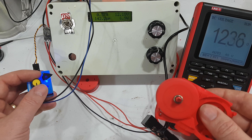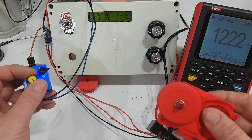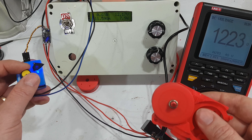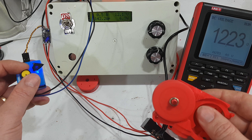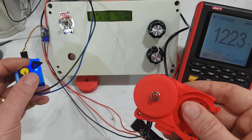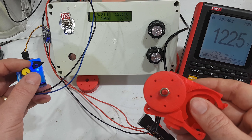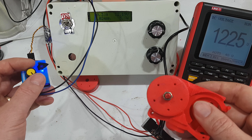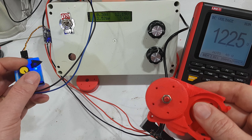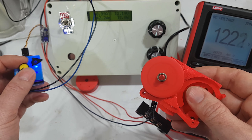There are ways to filter the regenerative voltage from going back into the Arduino using a Zener diode and some resistors, and of course there are more complicated ways. I mention it because it's an interesting phenomenon that'll happen on bench power supplies but probably won't happen with your battery. However, it may still happen in real life randomly. I've had a lot of problems with Arduinos where things work wonderfully in the test environment, then you take it into the real world and it starts acting randomly.